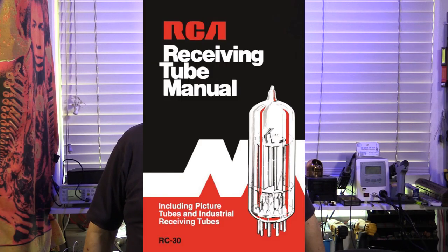Thirdly, we're going to look at directly or indirectly heated cathodes. These vary amongst manufacturers, so we will stick to the RCA data manual where possible. If a cathode is also the filament in the tube, then we say it is directly heated and the tube will conduct very quickly. I prefer the slow heating of an indirectly heated cathode, which has a separate cathode and filament. The hot filament has to then heat the cathode before it can start emitting electrons towards the plate.